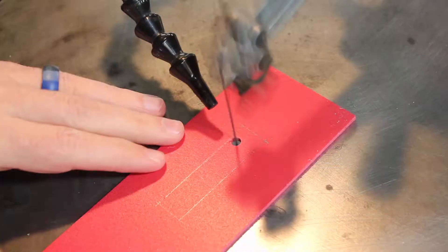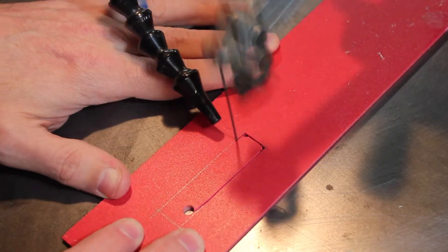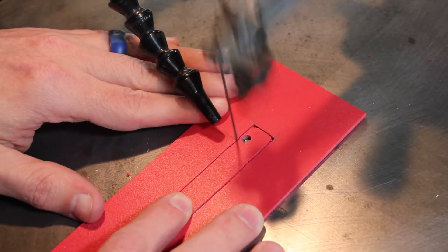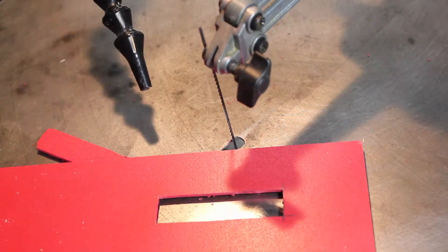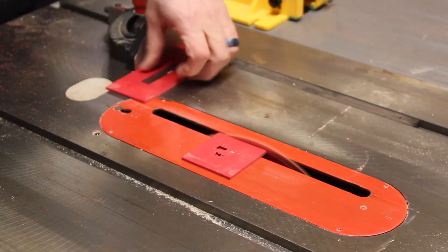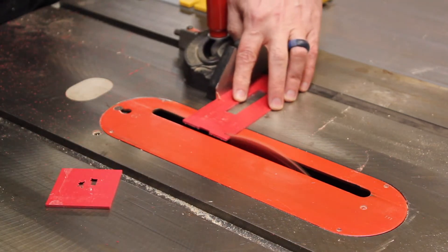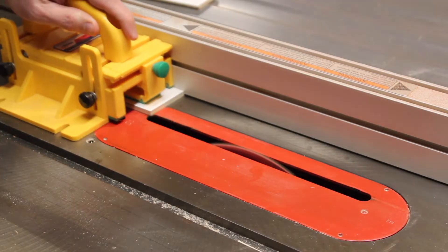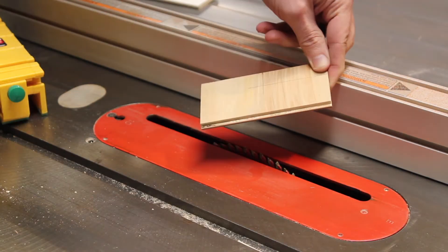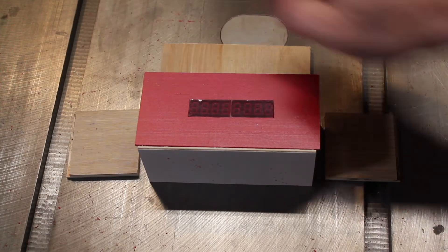The face is expanded PVC, which is sometimes called PVC foam. It's very lightweight and matte — I didn't want anything shiny. I'm cutting the face plate down to size. Here I'm making a small rabbet on one side, and you can see how the face plate fits in that rabbet — that will secure it.